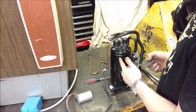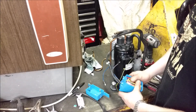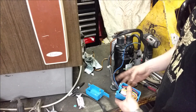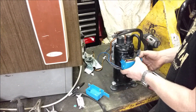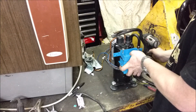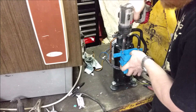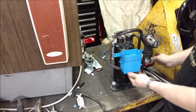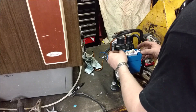I'm going to tack weld it. As long as I'm grounding to it and against it, the weld won't ruin anything. I've got the capacitor jammed in there with the two wires that feed power to it and feed power to the compressor motor itself. This will mount underneath this plate, and the switch box will mount above with the plate on top. The cap is protected down in there where you can't accidentally shock yourself, and the switch will be mounted up on top.